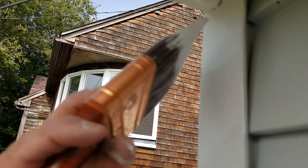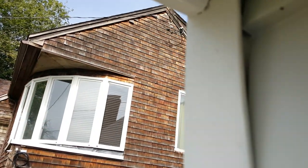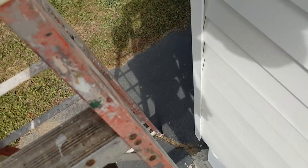Soften that line. This is vertical, you never go horizontal. You're gonna leave stuff like that. Those lines, once they dry up, it's gonna be seen. You don't want it sloppy. You wanna look professional. So you do vertical lines. Okay, I don't need to go any lower. All right, because now what I'm gonna do is I'm gonna roll all that all the way down. Okay?